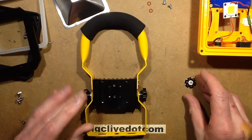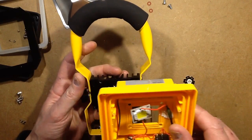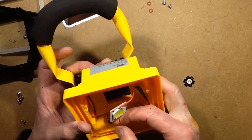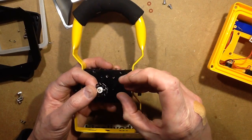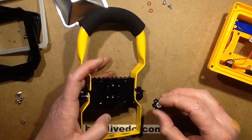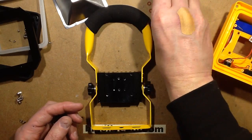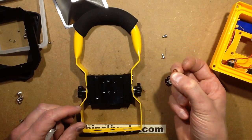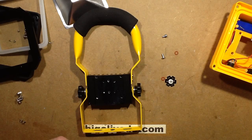Let's attach the new LED. Keep in mind that the connection at that end will be negative — although it doesn't really matter because I've got both connections effectively at this end. I'm going to get a bit of heat sink compound now and screw this on. I'm going to use three M3 screws, plus two fibre washers — these little red fibre washers that are good for providing extra insulation.